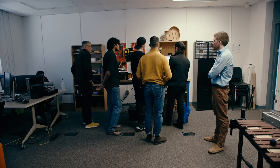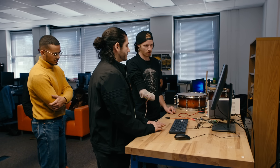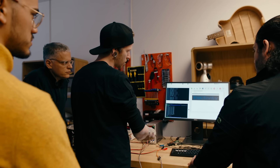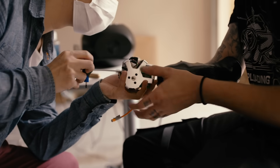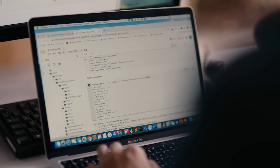And that's where we looked at all kinds of different motors, and TensorFlow was perfect for this project. We basically use TensorFlow as a tool for the deep learning trainings based on the data we collected through the EMG sensors. We need to see what kind of electrical activity happens when he's moving his arm in different ways. And then through TensorFlow Lite, which is actually a more efficient tool to use, we can apply that to the Raspberry Pi, a small device implemented as a general console. The TensorFlow model will actually predict Jason's gesture based on how he moves his muscles.